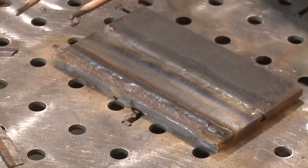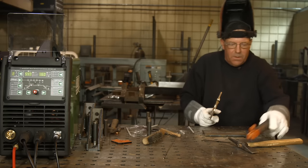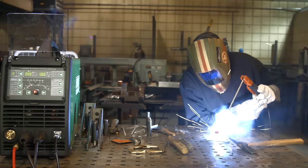I know this plate is super hot. I'm going to leave the machine at 160 amps, but I'm going to go take all the heat out of this plate — just dip it real quick to get a lot of that latent heat out. I went over and cooled the plate off. I left the amperage alone, still running the same size rod, and I can tell it's a different bead shape — and that's fine. I can feel the rod touching the toe of the previous weld; I'm using it as a guide. If you see me weaving slightly back and forth, it's because I'm old and not quite as steady as I used to be.